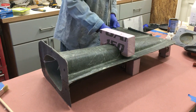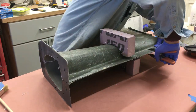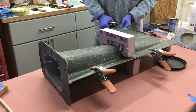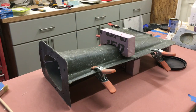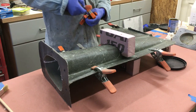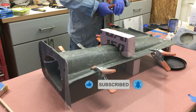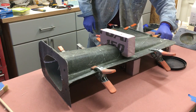Locking up all the alignment dots and putting a couple of clamps on. Unfortunately I forgot to put bolt holes in this mold, so I'm going to have to use a lot of clamps. I'm not going to start drilling with the splooge already applied — grit getting down between the halves would make it awkward to get the tape in. We'll just have to make the best of it with clamps.